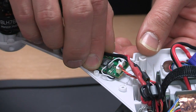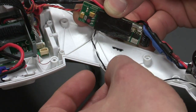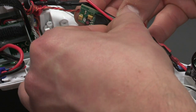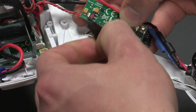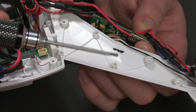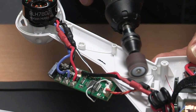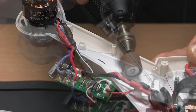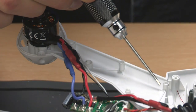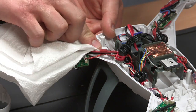In arm number 3, loosen the PC board. On the back of the board remove the double sided adhesive tape. Grab your rotary tool and remove the fillet indicated — note that we advise you wear a dust respirator whilst you are doing this. Before you continue, make sure there are no ridges and that the area is nice and smooth. Also clean the area, removing any dust particles.